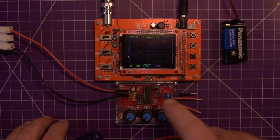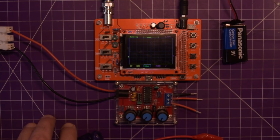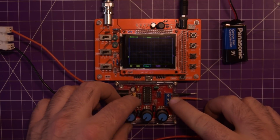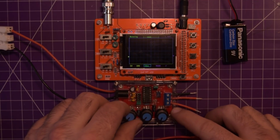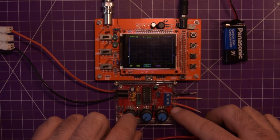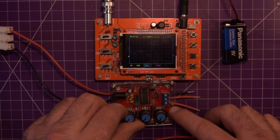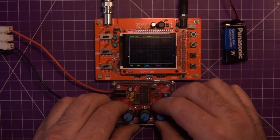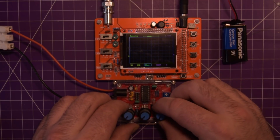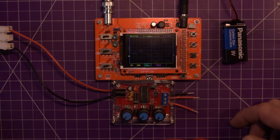So 9.5 volts. It's a 9 to 12 volt system. They say over 12 the wave becomes all crappy. I have this set to 1 to 10 hertz, so I assume if I have this at the lowest, then it's going to be at 1 and then probably move it up. Oh, sorry, that's the amplitude. Fine and coarse. So this one will probably be 1 to 10, and this will be just micro adjustments in between. Alright, so I'm going to give it power, voltage limit, which is good.